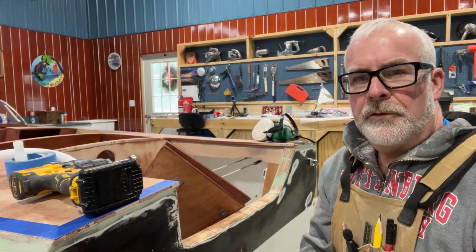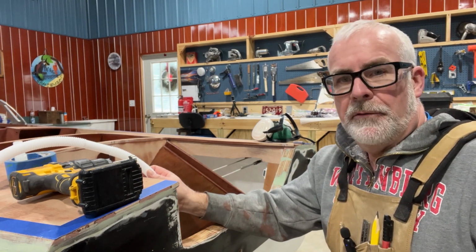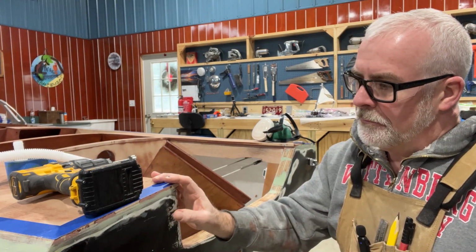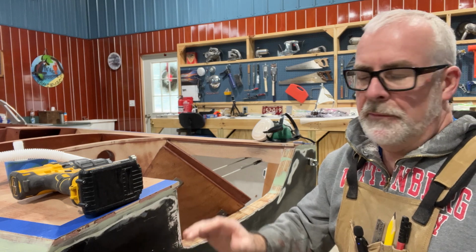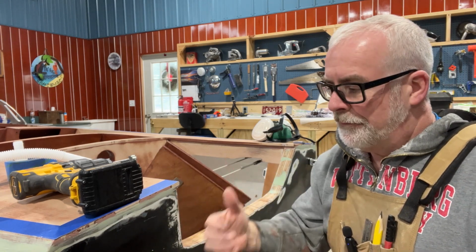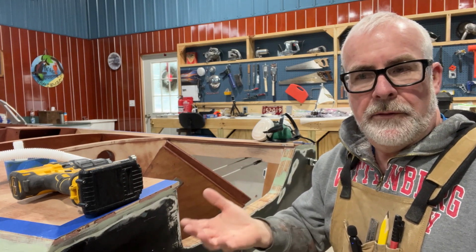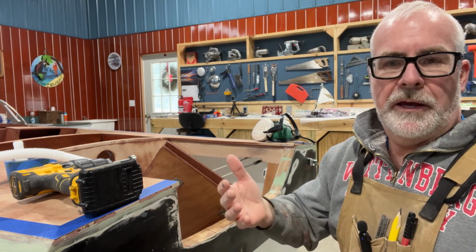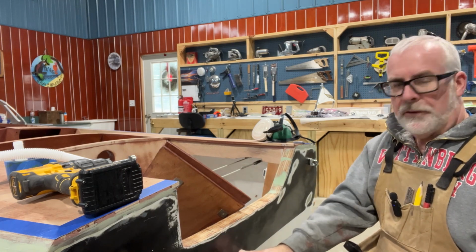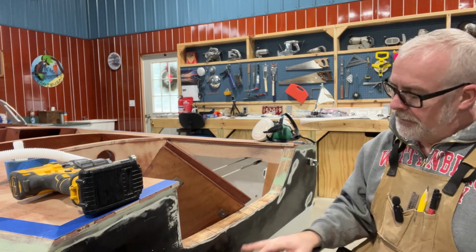One of the safety features I'm putting into this boat that wasn't originally part of it is a bilge pump. And in order to do that, by recommendation from almost everybody, when you put in a bilge pump through a hole fitting, you get that water in the tube as high as you can and out of the boat. So originally, I thought about putting it right next to the engine well area that will be self-draining.